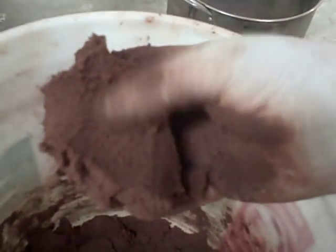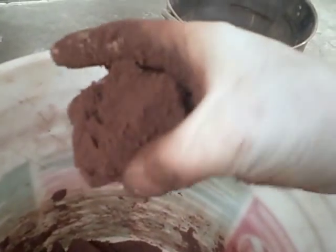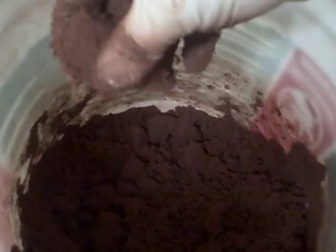I'm going to continue messing with this for a little bit even though it probably won't do any good. I think it'll be fine by tomorrow. Honestly I could probably ram up a mold - this is better than the green sand I had forever. It's actually kind of awesome, still a little crumbly but it is improving over time. Whatever acted as a catalyst in the last stuff - when I did the K-Bond and added the alcohol - it didn't immediately turn to cookie dough, it took a little while to get up to optimal green strength. So I'm guessing this chemical reaction just takes a little bit of time, which makes sense.